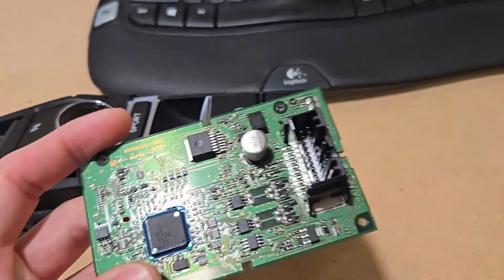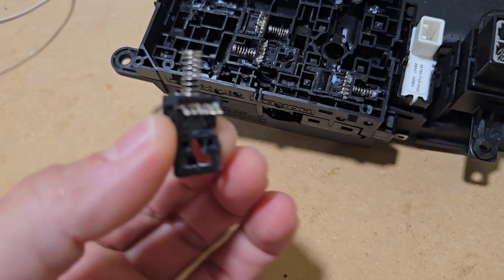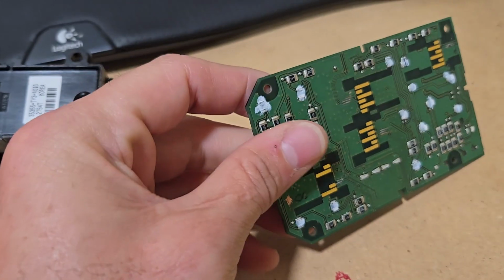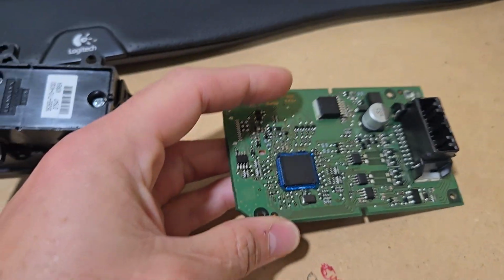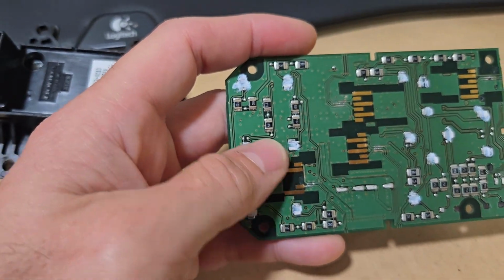And this is the control board that goes over here on the back. If you see these little things like this one that falls, they've got those little fingers. When you actuate from the other side, they slide here and complete the circuit and do whatever is commanded. I tried to use this original board, but I was expecting tactile buttons, and there were none, it's just this mechanism. So I reverse engineered this to do something that I can fit on my build.